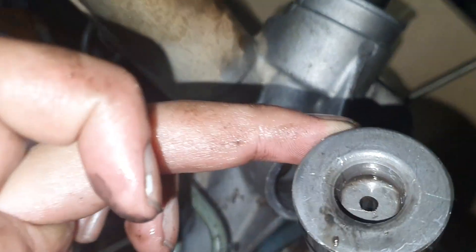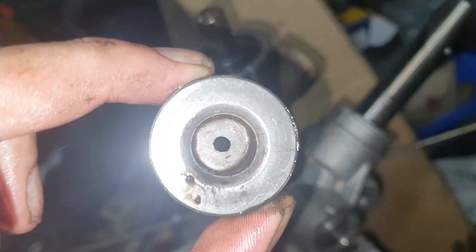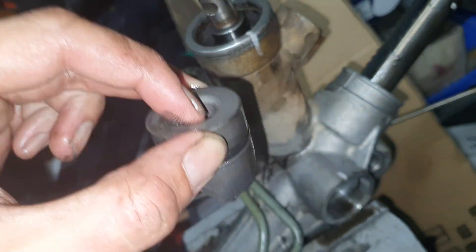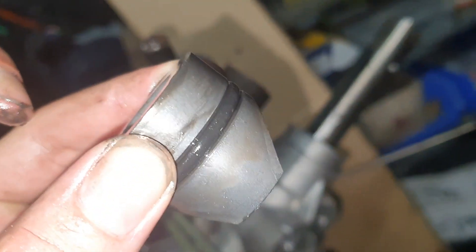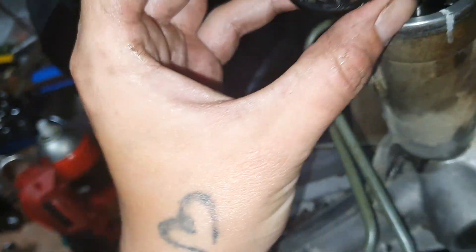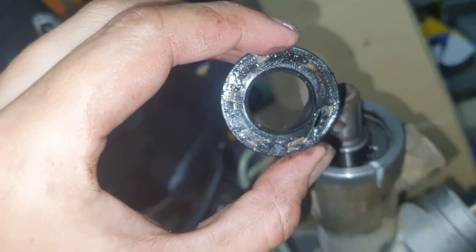Now I've just kind of tapped it in, put a screwdriver and held it on an angle, and kind of hit the top of it to try and bounce it to pop it up, because there's nothing to really grab on to. After doing that for a bit, playing around with it, it's come loose and I've got it out. Don't be afraid to hit it back down a little bit if it's come out because it helps free it up — it's got an O-ring, so you've got to get some pressure to pull it out.